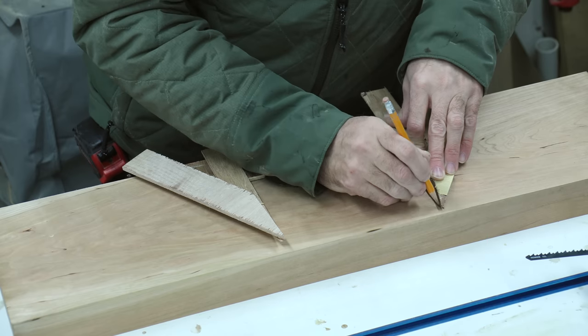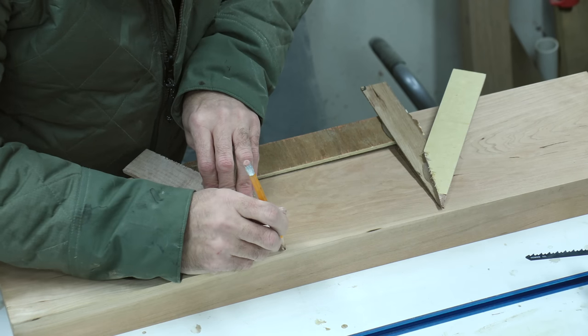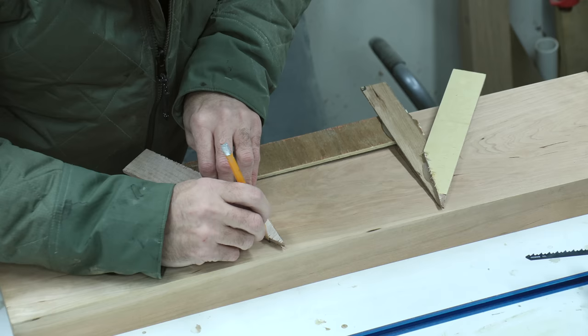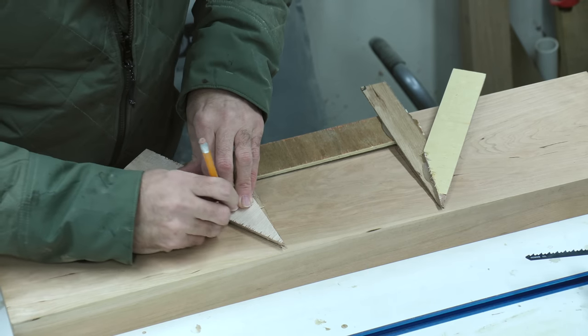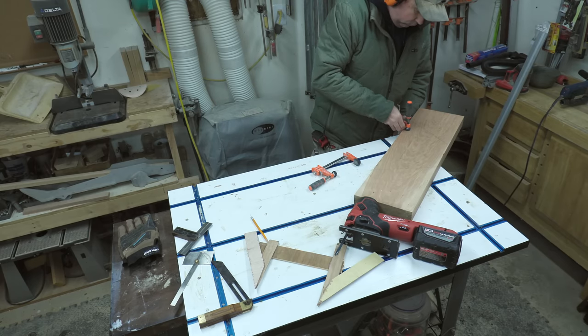Now, I don't like to make it a habit to use beautiful hardwoods as construction grade materials, but I had a beautiful piece of 8/4 cherry that would fit the bill for this installation. Cherry has good rot resistance, it's very strong and takes fasteners great.